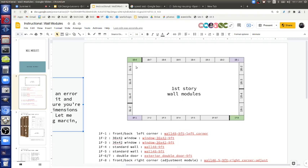Yeah, if I'm understanding your question correctly, yes, that has been discussed, in a sense that because the structure of the floor rests on the long walls, you want them to be throughout, as opposed to getting in the sides. They're not really load bearing. It's the front and back that are load bearing, because across this we're spanning all the joists. So the front side wants to be as strong as possible. Does that make sense? Does that kind of answer it?